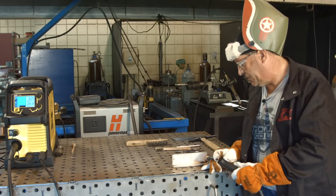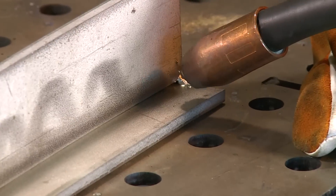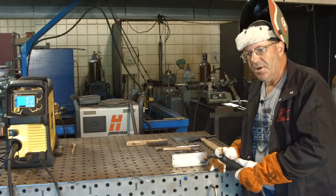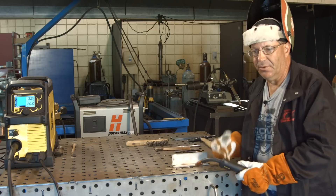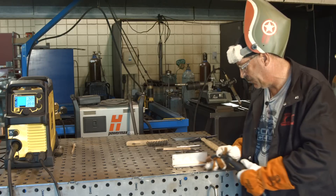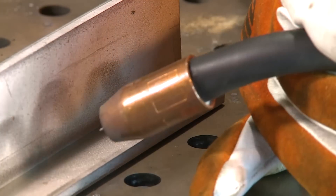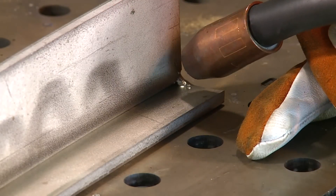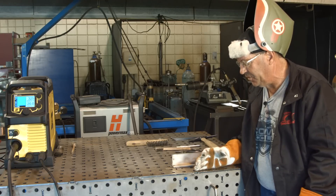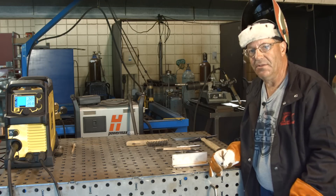I'm ready to weld. I want to keep my gun pretty much straight in, tilted forward maybe five degrees. What you hear off my mic should be a raspier sound — it may flutter and throw some sparks and BBs out. I want to rest my finger across the table and not do my normal stitch motion that I like to do when MIG welding; I just want to go across flat to try to make a consistent weld size. What I expect to see is the weld will turn out gray, but the mechanics and the profile should be okay.